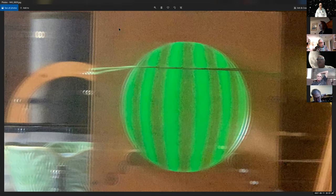If you go to that one, let's just start there. That image shows that the bands are fat in the middle in that central region, and then the second bands are fairly nice. Now, what he was telling me is that you go from about the 65 zone out to the 100 zone. This is inside R. And he was trying to tell me that the lines from the 65 zone to the outside are more spherical. They're undercorrected there. So they're flatter out there. And so I was going, well, wait a minute. How can it be flat in the middle in one picture and not flat in the other one?